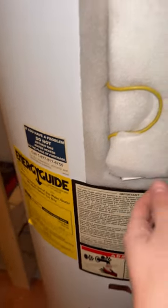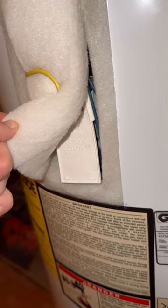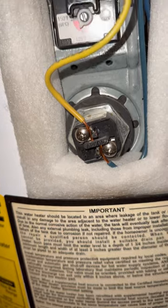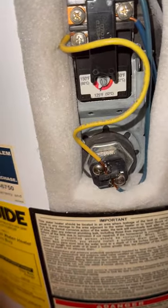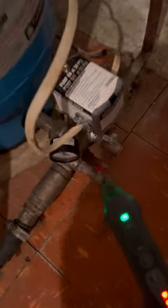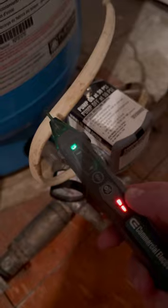There's a whole bunch of insulation behind here. Pull this back and you're going to get to a plastic piece — good, they kept that. Some places throw that away. Here are our main wires and there is our element right there that we need to change. Let me make sure this connection is dead — and it is. I can take both of these wires off and then remove that element. I'll triple-check: this is the power supply coming to the pressure tank, that's live and reading through the cover, so the fact that this isn't doing anything reassures me it's definitely off.